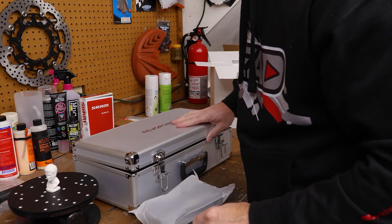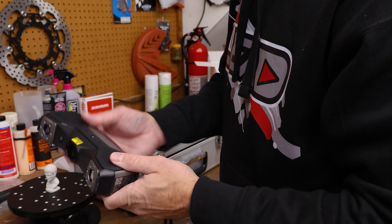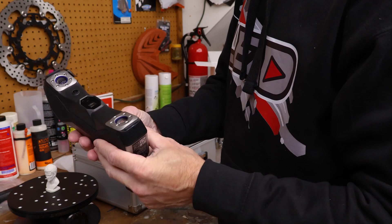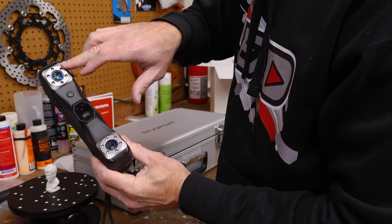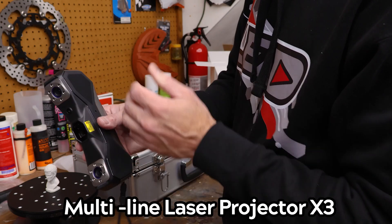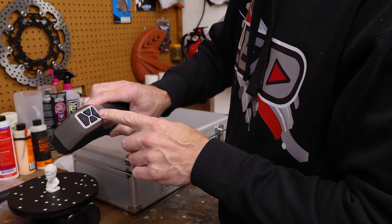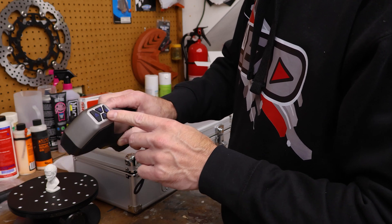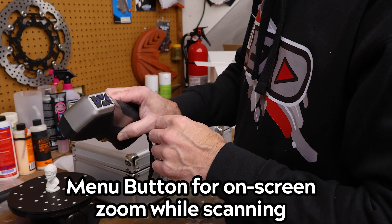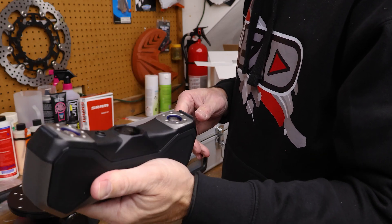Last but not least, the actual scanner. It's actually quite a bit lighter than I thought it would be, probably just because of the bulk of the case. It seems like we've got a plastic case, depth cameras, and it looks like they've got some illumination LEDs. I would imagine this is an RGB camera for color scans, and in the center is where we're projecting our laser pattern out. There's a USB-C connector on the backside. We've got a couple of buttons on top: play to start and stop your scan, plus and minus for setting exposure value, and an M button — my guess is it switches between manual and auto exposure. It also has a hand strap so you don't drop it.